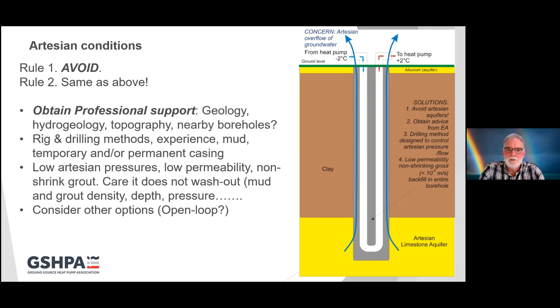To drill in artesian conditions, your drilling mud needs to be of a density to control the water in the aquifer so it stays down there. You may need temporary casing; some rigs have twin heads so you can pull casing down behind your drilling bit to try and seal off areas with groundwater flow. However, it is really only possible in very low pressure situations or where the groundwater is around about ground level. Otherwise you can very quickly get into trouble if your artesian flow washes out your drilling mud. Grouting up an artesian borehole also needs very careful thought and design as to the density of that mud and whether it can hydraulically control the artesian water flow.